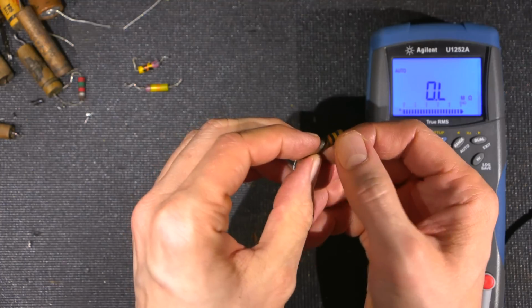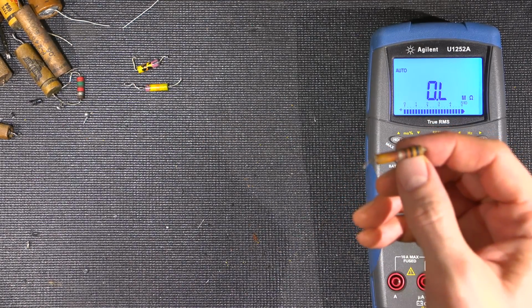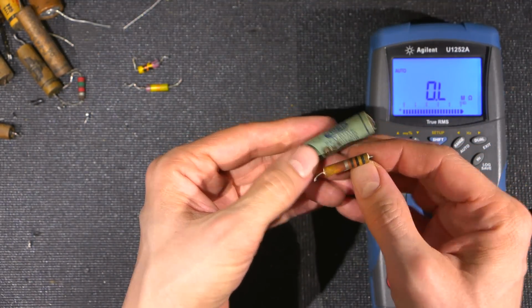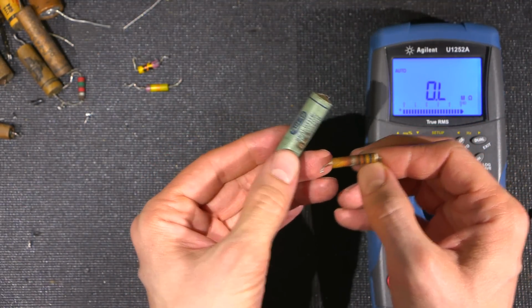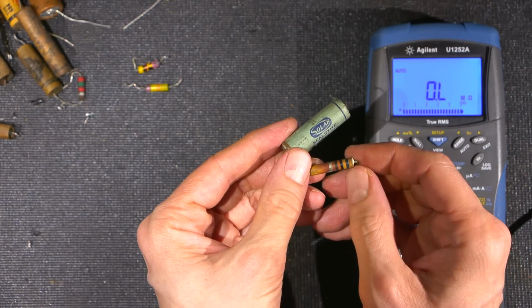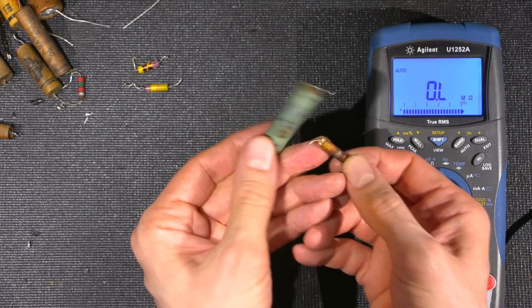capacitor, nothing else. There's nothing that should really heat this resistor that hot. So this one right here is the reason that this one got so hot. So this was dragging, there's B plus on one side of this, and then of course this is dragging the other side down, making this thing change color. And even the color bands have changed. It's hard to read now.